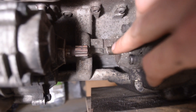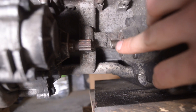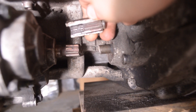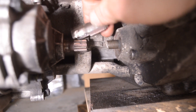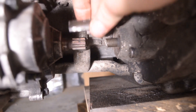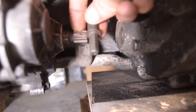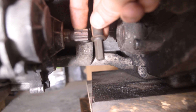Next, we're going to remove the coupler that feeds power to the oil pump itself and then subsequently to the water pump. I had to angle grind it off in three locations — it was totally seized on there and it's going to be seized on your car as well. Ideally, you'd have this sit in there and then you'd have another shaft coupler over the top that you can slide back towards the back of the motor, with another circlip. But it's not going to happen — it's going to be totally seized on. Just get your Dremel out and have a little bit of fun with that. If you have an earlier Gallardo, this shaft coupler is going to be totally destroyed and you're going to want to replace it anyway. Either way, you're going to have to replace it, so just order the parts before you do any of this work whatsoever.